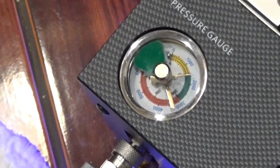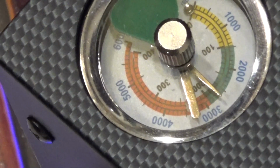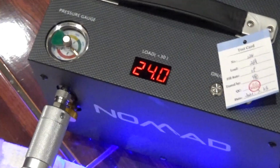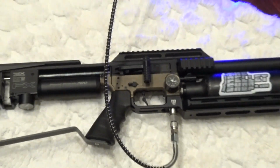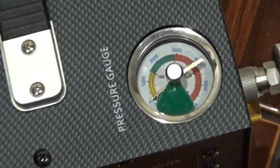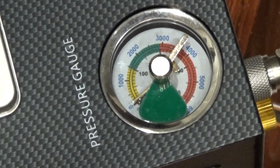If you guys didn't catch it already, here's the basic process for starting this compressor. First you plug it in and you'll faintly hear a little capacitor running inside there. Step 2, you're going to turn your power button on and you'll hear your fan ramp up and start running at full speed. Whoa. I went ahead and set my pressure gauge right there to 250 bar, I believe. So just watch how fast it's going to build pressure and then shut off.